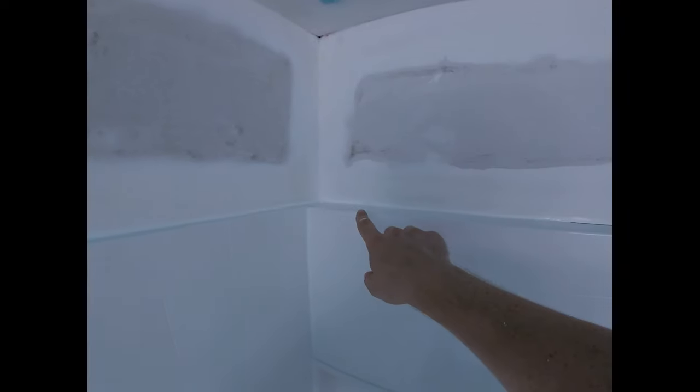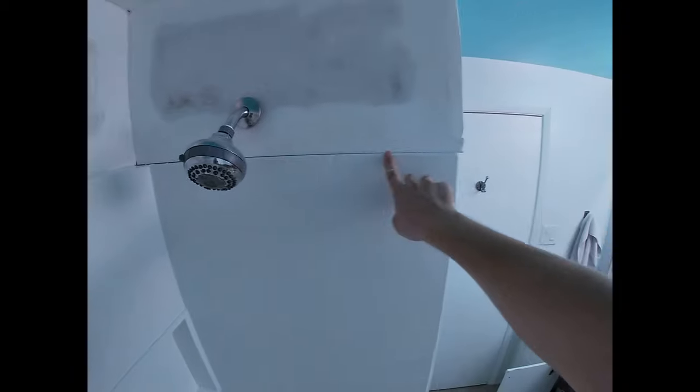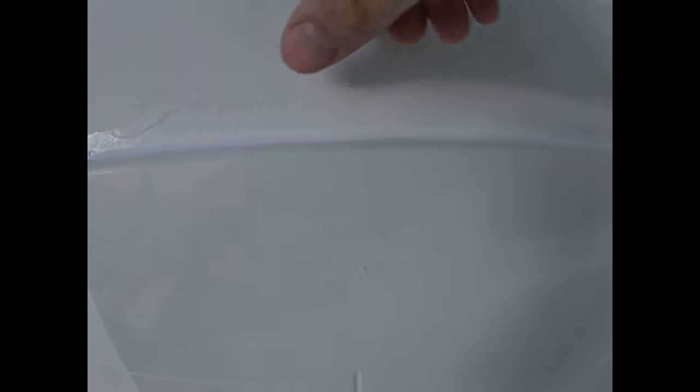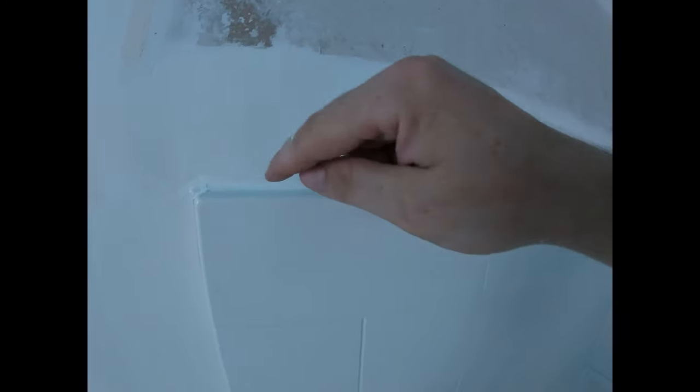That's all there really is to it — you do the same thing all the way around all your edges, going along the top and down each side. Now, in case you're wondering why we did the caulking before the paint — usually you do it after — I prefer doing it before because you have a little more forgiveness. If you look closely it's a thick bead, and with colored paint it'll show up. But if I do it first I can tape my line so the caulking will barely show — it'll be kind of hidden. Hopefully you found this helpful, and as always please like and subscribe.